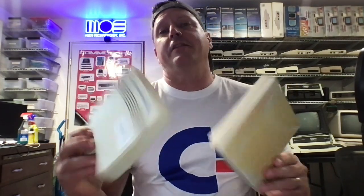Hey everyone, my friend Tony Schiffbauer purchased this Commodore 1700 RAM expansion unit this year at VCF East — I think he got it in the consignment room. The 1700 is a 128k RAM expansion unit; its big brother the 1750 was a whopping 512k RAM expansion unit. The cool thing is the 1750 and the 1700 have the exact same board inside them, so you can actually really easily upgrade the 1700 to a 1750 just by replacing the DRAM with beefier chips. That's what I'm going to do in this video today.